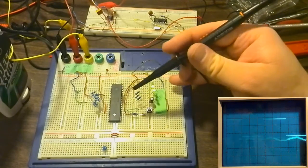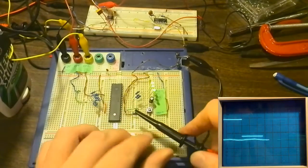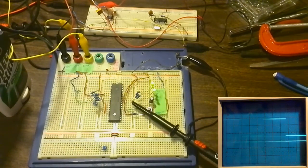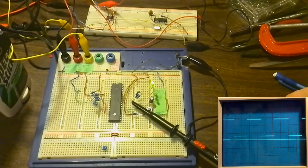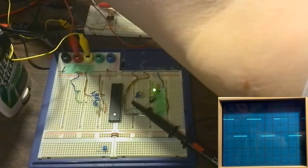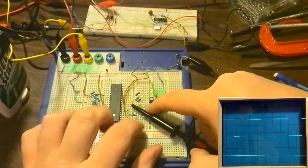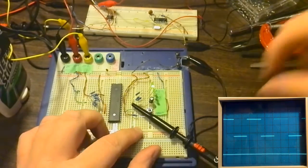These address lines should each have a different frequency. This one should be the fastest one — that's my A0 line. As you can see, it's very noisy and it's constantly crashing. But this is at around 130 something hertz.